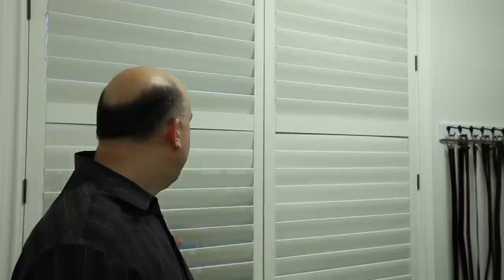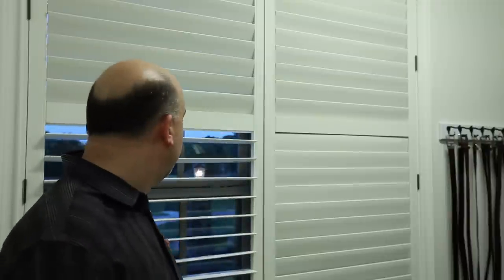I have built several shutters around the house — this one in the master suite is about three or four times bigger than the one you saw in the video. I decided to use what's called a hidden control arm system. On older shutters there's a bar in the middle that you move up and down, but these don't have that. They simply open and close just by moving any one of the louvers. To me that's a cleaner, more modern look and I really like it.